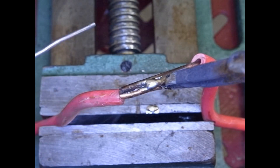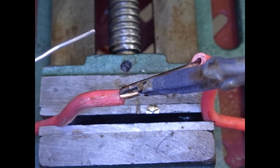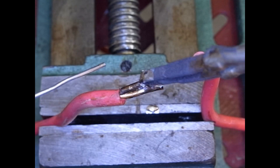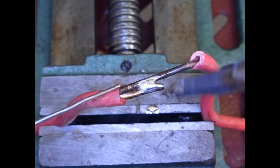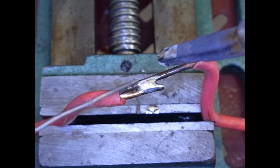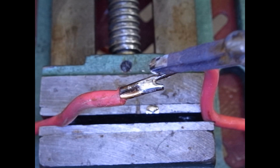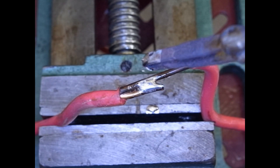If I put enough flux, I might get the flux to actually hold it together. That is something that happens — you get the flux holding it together, then you pick up the joint and it pops apart. I'm getting very little adhesion here. Just a dirty joint. You waste a lot of solder, you waste a lot of time. This is not a good joint at all. You can see the bad coloring over here — that's an indication of a cold joint, a dirty joint. The best thing that can happen is you get a crummy looking joint. The worst thing is you get a connection with no electrical connectivity at all.